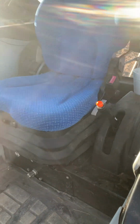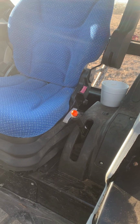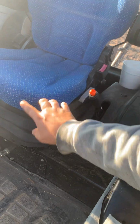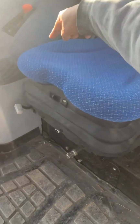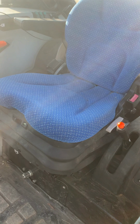You cannot unplug it from the back and try to hot wire it or jumper it like you used to be able to, because it senses it, and it says it's an open ground or whatever. Don't quote me on that. But there's 2 1/4 turn screws. If you get up under the seat, there's 2 1/4 turn screws, one right here, one right here. The seat cushion will pop out, and you can access that sensor really easy.